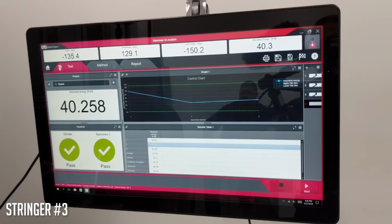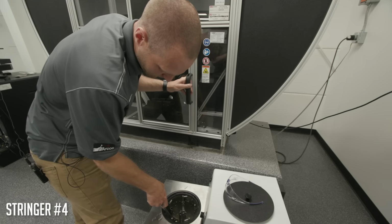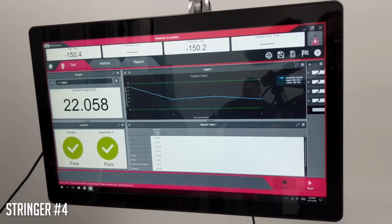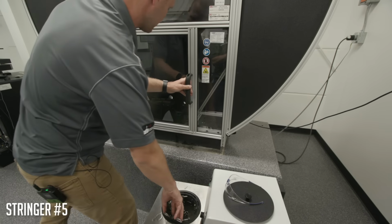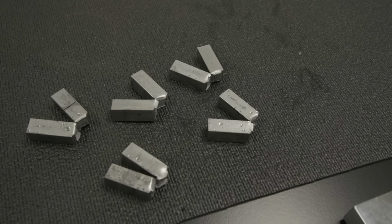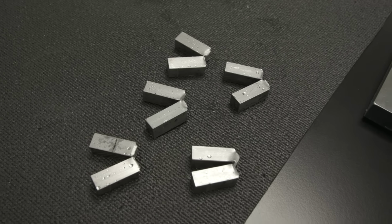All right, so we tested all 5 samples here. There was some scatter in the results. You have an average of 43 foot-pounds, 43 and a half. You drop the high and the low, you would probably be around 37-ish, so it's passing AWS conformance testing. It's 20 foot-pound minimum at 0 degrees, so sample conforms. Awesome, so let's go ahead and test the weaves. Yep.